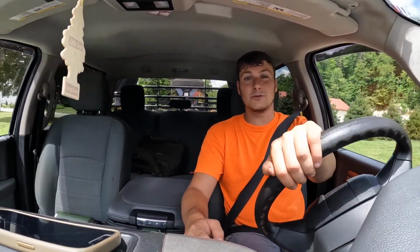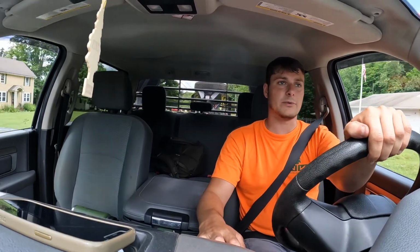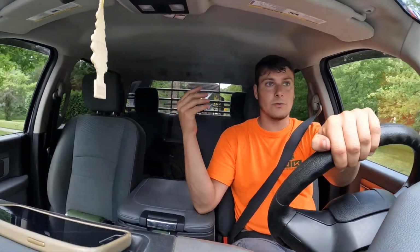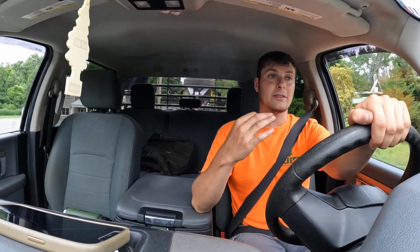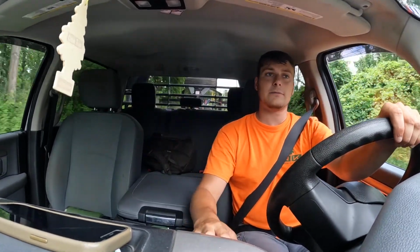That soil was just going to stay too dry because of our drainage that we put in, and plants really weren't going to do so well in there anyway. So we just did a decorative river rock coating on top of all the 3/4 stone. The driveway had a strip of Belgian block down the side, so the water that would fall on the neighbor's driveway would be pretty well contained and not go near their foundation. But any precipitation or runoff that made its way into that trench will get carried away by the foundation pipe. And the three gutters, which we think were a big contributing factor to water in the basement, the gutter pipes all got carried away.